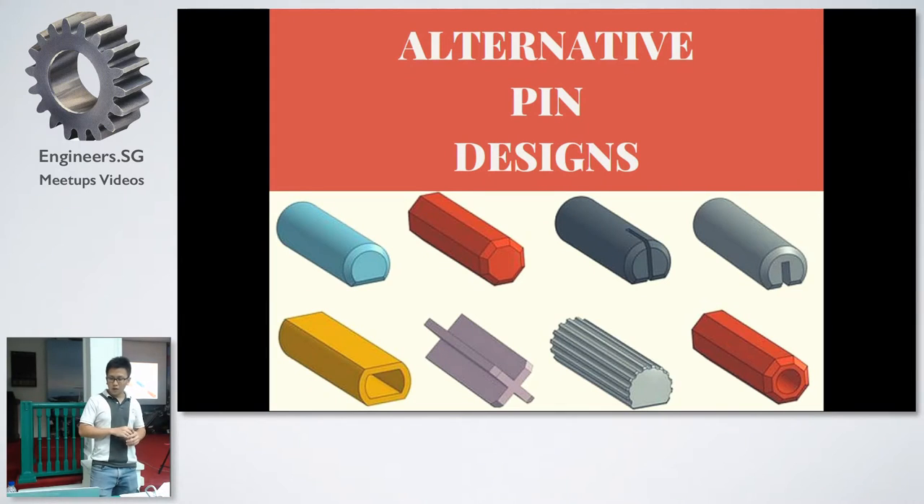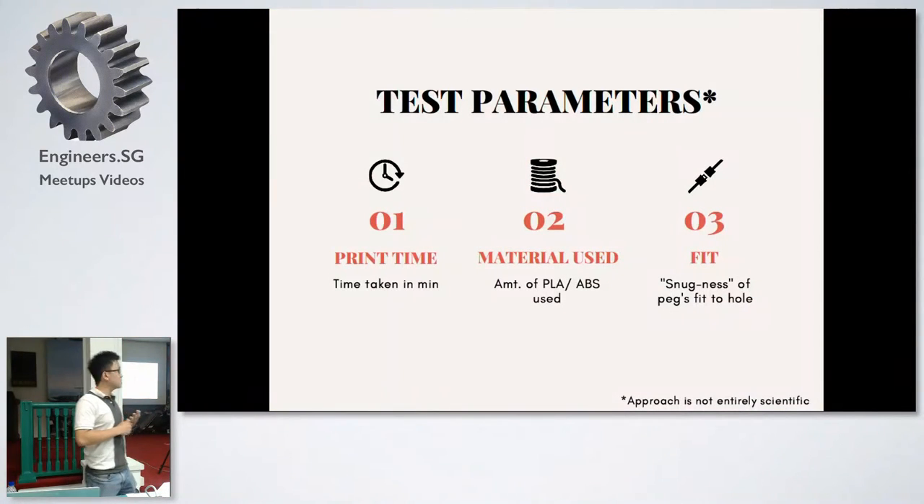It's tedious — you need to make a slightly smaller pin, and even then that tolerance difference will change if you make a bigger pin and a bigger hole. So it's a lot of trial every time you want to do a press fit part. The author, Kurt Hamill, created alternative peg designs so that if you have a one centimeter hole you create a one centimeter peg in your CAD file and don't have to think too much about it. His findings concluded that the bottom-right octagon with a hole was the best fit.